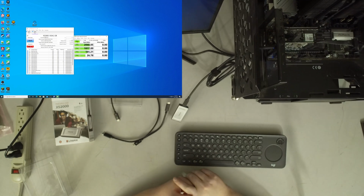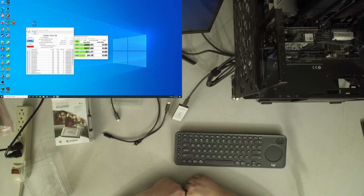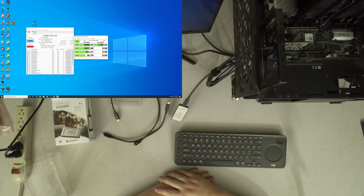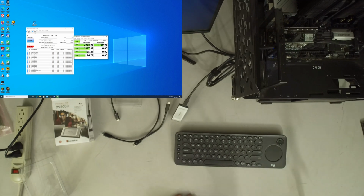This video is about the iDsonix USB 3 Gen 2 by 2 20 gig controller, and it works. It seems to be solid. I don't really have anything to comment on it one way or another. The controller chip got a little toasty. It's 45 Celsius. It's uncomfortable to touch, but not so warm that in a case with normal airflow or an open bench like this, I would say it's an issue. Would I feel better about it if they had glued an itty-bitty heatsink to it? Always. I mean, just always I would have felt better with a heatsink, whether or not it got this hot.